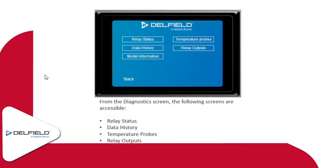Diagnostics, probably the stuff you guys are most interested in. So I saved the good stuff towards the end here. You can go into the diagnostic screen. You can look at the relay status, and data history, and temperature probes, and model info, and your relay outputs. You can check all that stuff from the diagnostic screen.